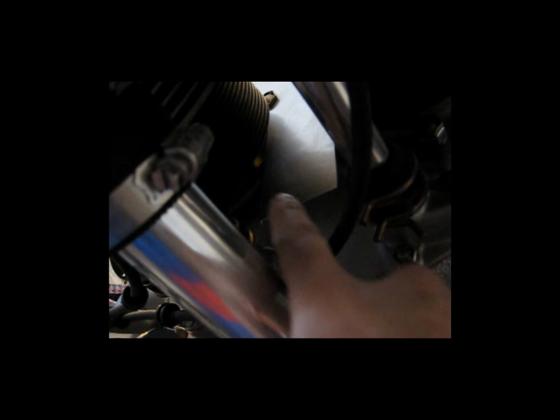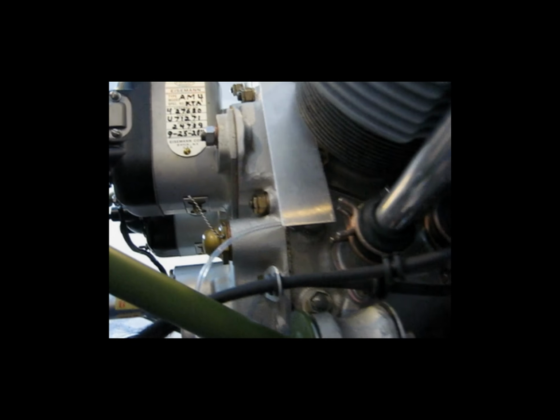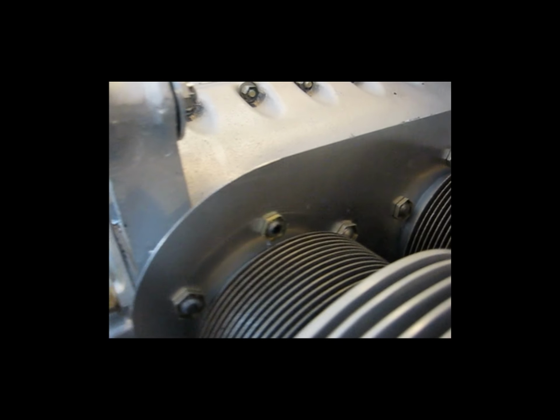Now I could either trust my template and use my template mark, or since I can physically see with everything being held in place with the pound nuts, I could physically come in here with a marker and put a mark right where that stud is, and then cut this notch out. And I don't think it's going to get up underneath here at all. I guess it does. But you could see here potentially, I don't know if it's going to be blurry, it's resting on top of this one, and it's resting on top of this other one up in here somewhere. So those will get notched as well. So that will be the next thing that I do then, is to notch those clearance notches for those studs that are along the bottom of these cylinders. And then I'll come back and I'll put this back on and see how it all fits.